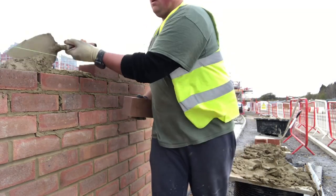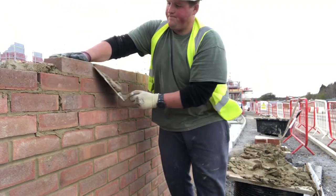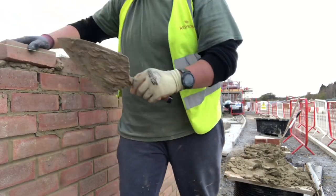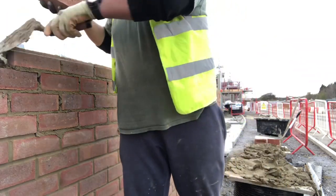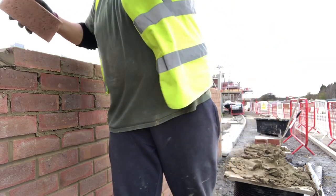And then finally, if you can get hold of a 10-inch trowel cheap on eBay or something like that, transition down to the one trowel full of mortar per brick pick and dip. And it just gets more intuitive over time. Expect a little bit of wrist ache when you first start doing the pick and dip, because the movements are very different.